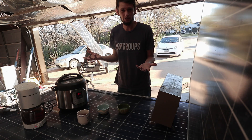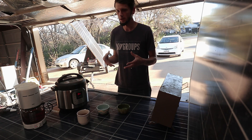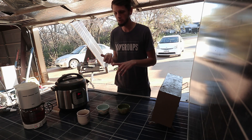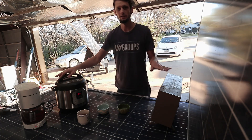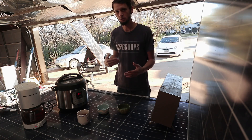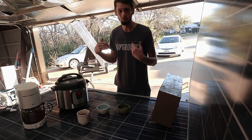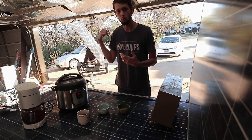Let me know if you've got tests or worries — what have you run into when searching for your own off-grid system? I'm going to put some links below for power budget calculators. You can throw in all your appliances and see: if I run the InstaPot for an hour a day, the coffee maker for 20 minutes, and the heater for three hours, how much solar and overall power do I need? You've got to figure out how much of that power is going to be when the sun's down. Right now the sun's nice and bright — those panels are pulling in about 550 watts here in the afternoon sun. With flat-mounted panels you can't really count on that much wattage, but it's 800 watts worth of panels pulling in 550 watts pointed at the sun.